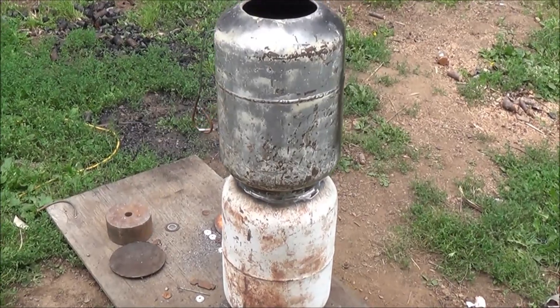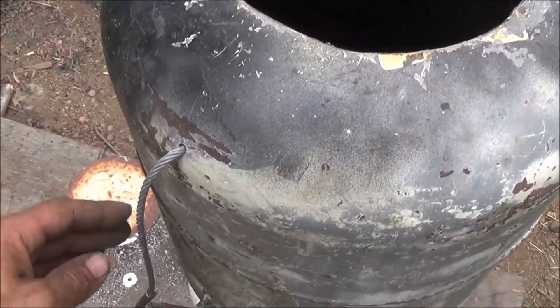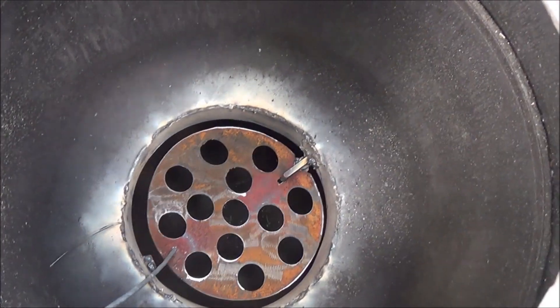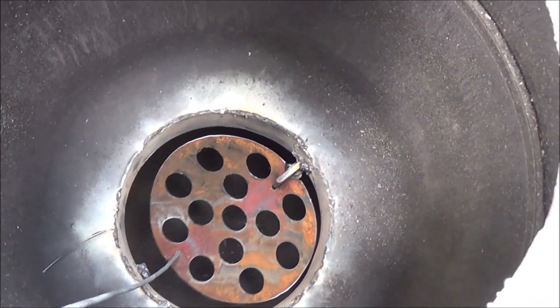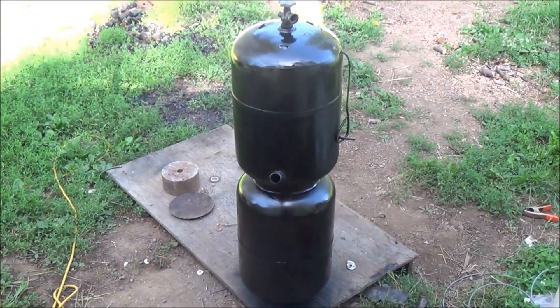I've got the upper and the lower now able to sit down inside of each other. I finished the screen that was in there. You can see the cable coming off of that going down to a little peg here that holds the loop. If I unhook the loop and show you down inside — all I've got to do is do that — and we can now clean the screen in between. You probably only want to shake it just a little bit like that. Then you pull your loop down over that peg, and it's going to hold it there and your screen's shut.